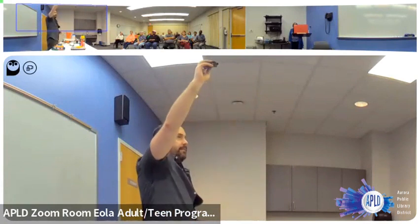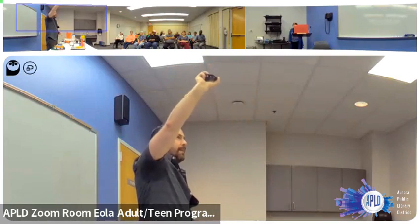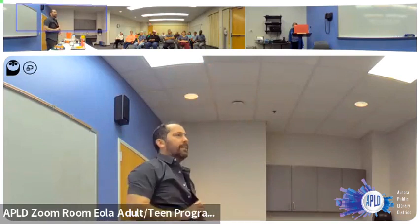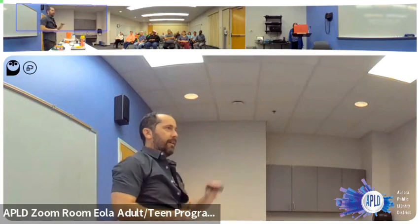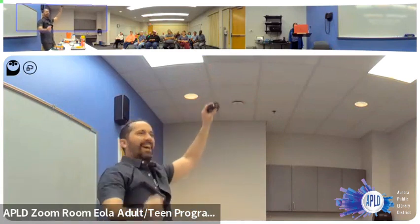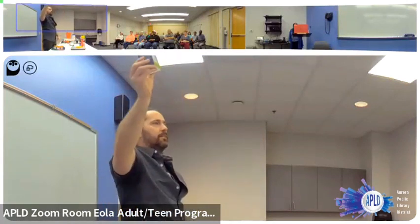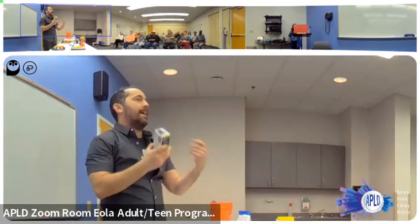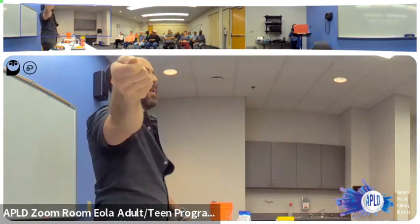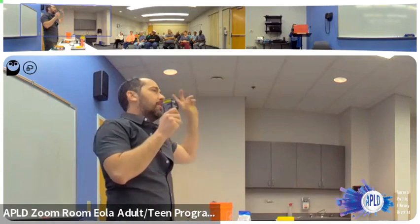This thing protects it. Okay. If there's a short, this will trip and save the building. Okay. This is 15 or 20 amps worth of power to make it do that. 15 amps will kill you dead 7 times a week. Okay. 15 amps will leave you smoking on the floor. And this thing will sit there and just pass power through it. Okay. This thing does not care about you. This thing loves you. We put these in your sinks and things like that so that if your hands are all wet and then you go to plug in your coffee pot, this will know any amount of voltage leaked to what they call ground.